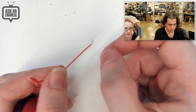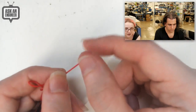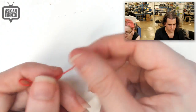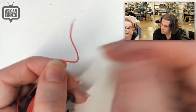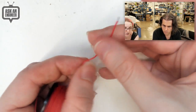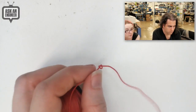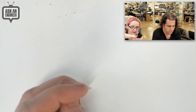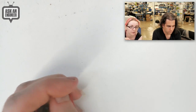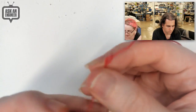That's really useful because you can cut the exact right length of wire. You don't have to add two or three millimeters, then keep cutting and stripping it to get a short amount of exposed wire. When you solder it, it doesn't burn or melt — you can hold this against the soldering iron and it won't damage the coating. So especially when you're soldering wearables or small projects where you have a wire harness and don't want to worry about damaging it, these wires are amazing.